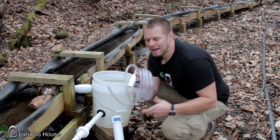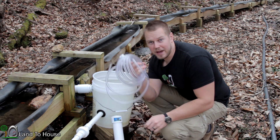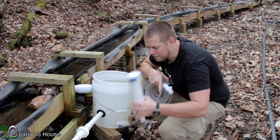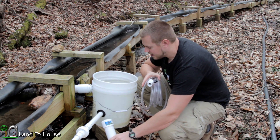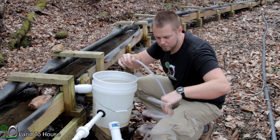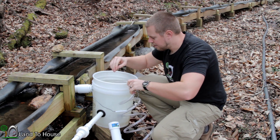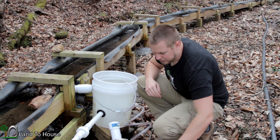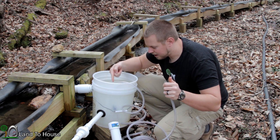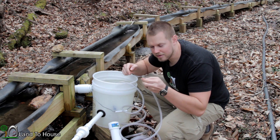I have 20 feet of drive pipe here, which is 3/8 inch inner diameter to match the two check valves of the pump, and I'm going to be sticking this into my bucket here — that's the intake of my other ram pump. I'll plop that down in there, and then I'm going to prime this drive pipe by siphoning water out of the bucket into this pipe.